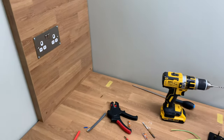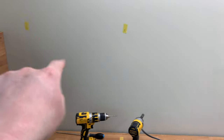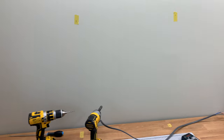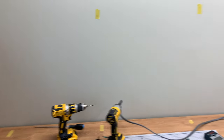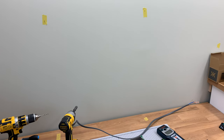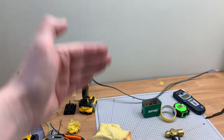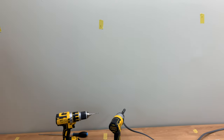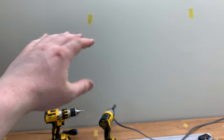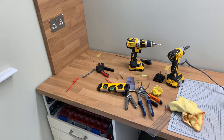That's all nicely wired in. The next thing to do is to get this back piece on. I've remarked the stud locations so I can see what I'm doing for drilling the holes and where I'm mounting those. I'm going to be able to get probably six screws, decent sized screws, into the studs. That should be absolutely fine, because the weight of it is actually taken up by the top underneath. But sometimes if I mount the filming jig with the camera on, there's quite a lot of cantilever weight on it, so it does need to be nice and strong.